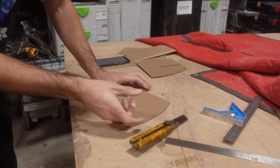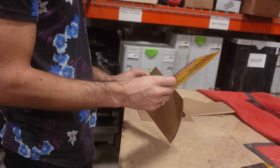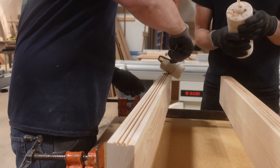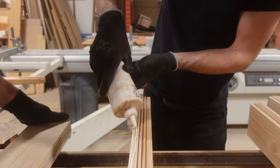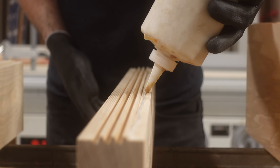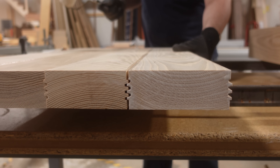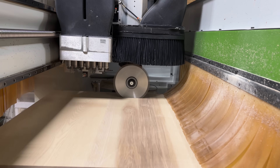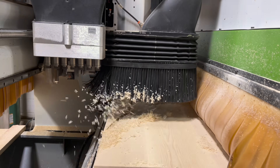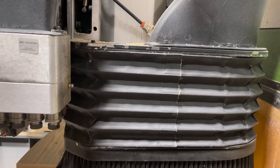Now on to the base for the buckeye burl table. This one was unique — it features half lap joinery, but we had two pieces both sitting on an angle, and it was hard to wrap our heads around how to make them. Curtis made some cardboard mock-ups half-lapped together to get an idea of what it would look like. Once we had a plan, we began gluing up the material — also using ash, also going to get stained black. We put a finger joint on all the edges of these pieces before gluing them together, and once cured it's over to our CNC machine to cut out the rough shapes. There are four total pieces: two with the notch in the bottom and two with the notch in the top to form the half lap.